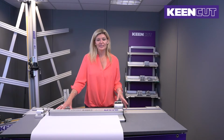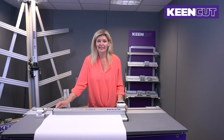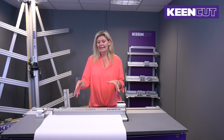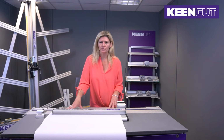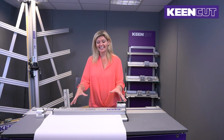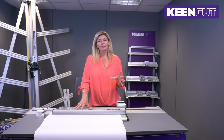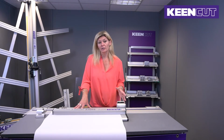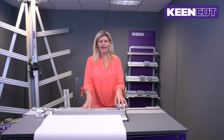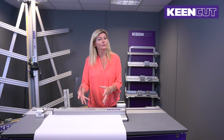The next machine we're going to cover is the Saber. Now, the Saber comes in slightly different sizes from the rest of the range. As I mentioned previously, it starts at 1 meter in length. It also has the capacity of a continuous cut. Now, very similar to the Simplex, it's a portable machine, slightly different because it actually has a base plate integrated into it. The guarantee of the precision of the cut is 1 millimeter over the whole length, as with the Simplex, and it also has plastic bearings for the head, so the motion isn't as smooth as an Evolution 3, for example.